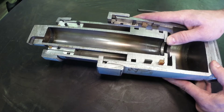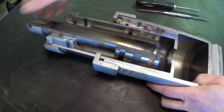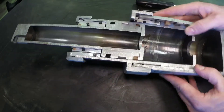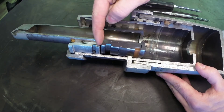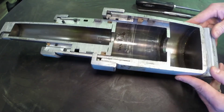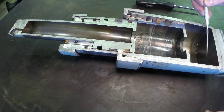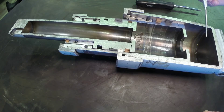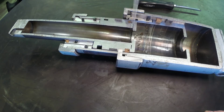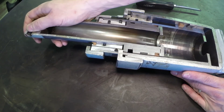The second stage will then extend until it makes contact with the cylinder head as well, reaching maximum extension. Pressure could continue to rise at the directional control valve until we hit relief pressure, at which point it will go over relief. To retract the cylinder, using the directional control valve to connect this line back to tank, we will see the flow leave out of the cylinder with gravity doing a lot of the work.